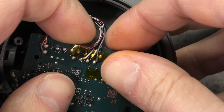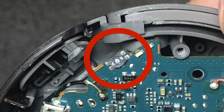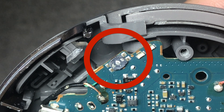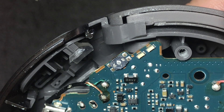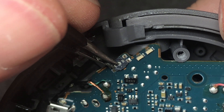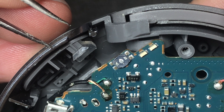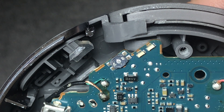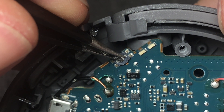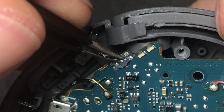When we look at the location where the on/off switch is supposed to be, I can see there's only a little bit of plastic here — that used to be the switch, so it completely fell apart. Now we only see a couple of open metal contacts. If I shorten the center contact with one of the sides, we can test if the rest of the headphones are still working. You can see we're shortening those two contacts and the headphones just turned on, and if I shorten them again they turn off.